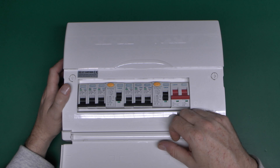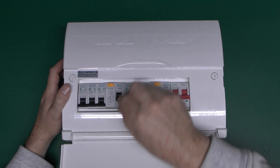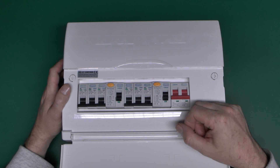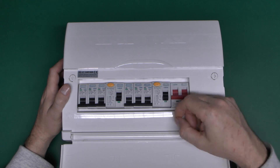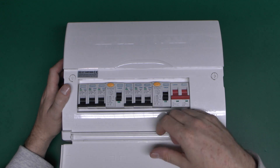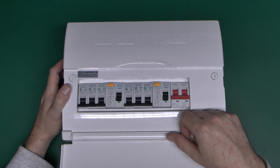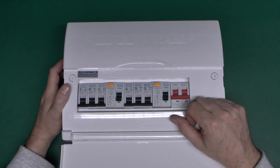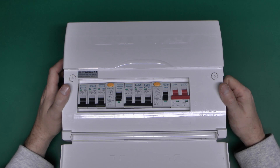The major disadvantage with this style is that although you've got two RCDs, any fault on one of these three circuits will cause this one to trip. Likewise, a fault on any of these three will cause this one to trip. Faults do tend to happen fairly often because things like kettles and irons - you've got water in them, and if anything goes wrong inside, that's going to cause a fault to ground or earth. The problem with this arrangement is that although you may know which set of circuits has been affected, it doesn't really tell you which of the actual individual circuits it was. The better way is to have RCBOs - which is the RCD and MCB combined - and then you have one for each circuit individually, but they don't tend to get fitted that often because they cost more.